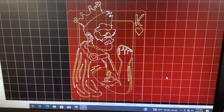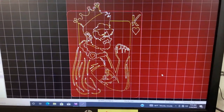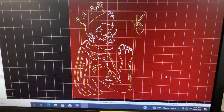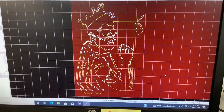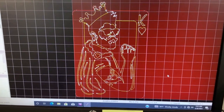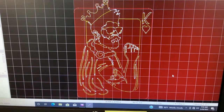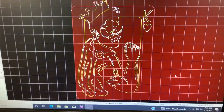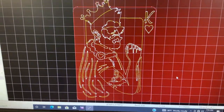This is where we pretty much make sure everything's all squared up. We set the different inner and outer layers, direction of cuts, and we always want to cut the inside of the product first and then the outside last. If you do it in reverse, what happens is if you cut the outside, then it could shift while it's doing all the cutting on the inside and affect the quality of the cut.